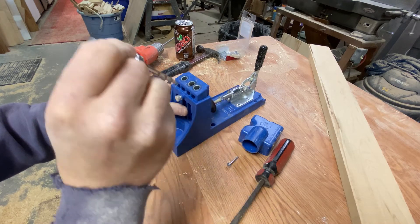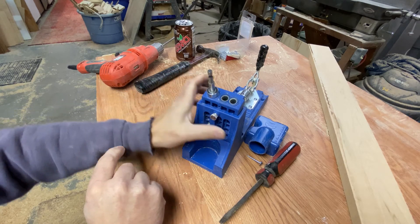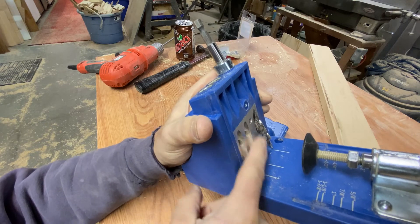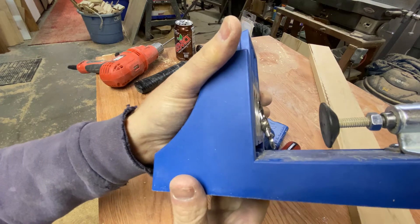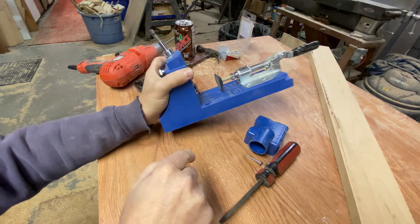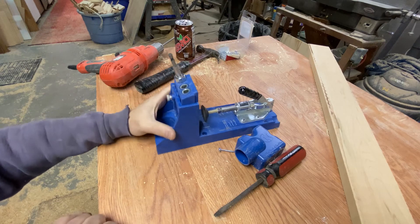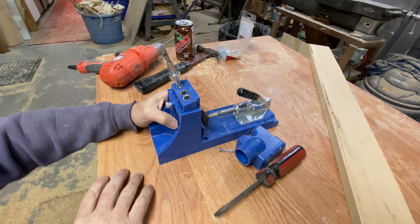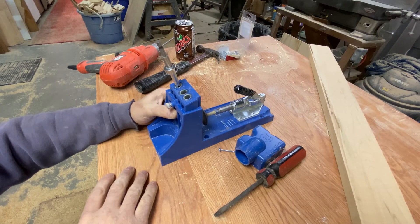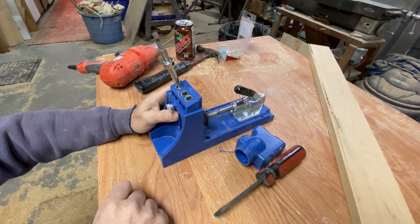These things are just great — I really, really like them. One last thing: when this is in the drill, you would drill down into these holes and the collar stops it. If the wood was there, you would see it drilling that pocket hole in. You don't want it to go through that first piece — you want it to stop, so the screw can pierce through into the next piece on its own. That's how you set up a Kreg jig. Link will be in the description. If you have any questions, please ask and comment. I appreciate you supporting the channel by clicking that like button and subscribing. The best thing you can do is comment, like, subscribe, and share our videos. Thank you very much, have a great day, and we'll see you in the next video.